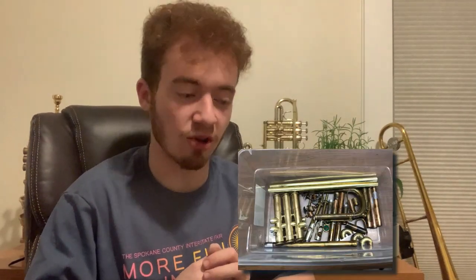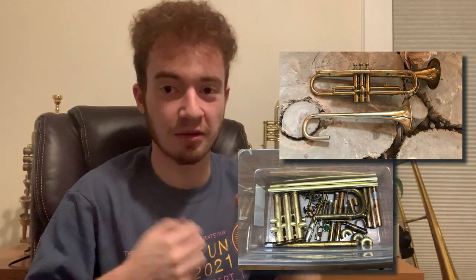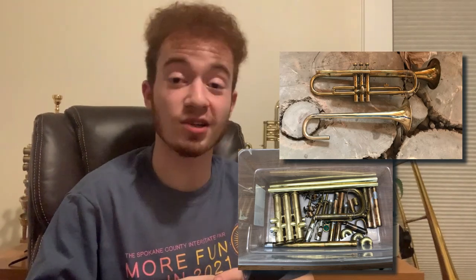We made sure these lead pipes would fit on this trumpet when we designed it, so that we'd have the option to play in either F or E, and could choose between either trumpet or cornet mouthpieces depending on the sound and style desired. For this frankly interesting and hitherto nearly unattempted task, Brent had a few things lined up. Before we met, we did some blueprinting, had some of the math hashed out, and he also had some parts which belonged to an old European stencil trumpet.